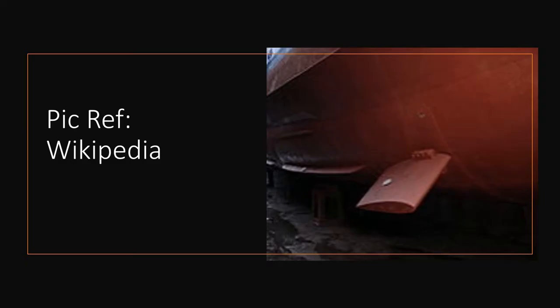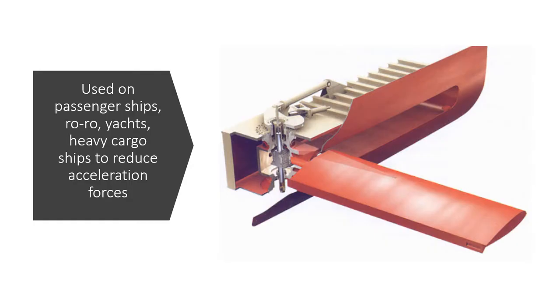The angle of attack of the fin profile is adjusted to the direction of the flow of the water. You can see here how the stabilizing fin is protruding from the bilge keel of the vessel. The fin is oscillated by a hydraulic piston or a vane type motor. The angle of attack, rotation speed, and period are dictated by a computer receiving signals from sensors in the rotating shaft, comparing the produced force with the required force, and from a gyro.